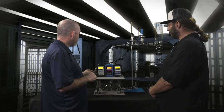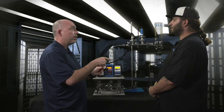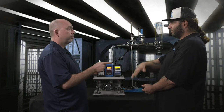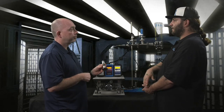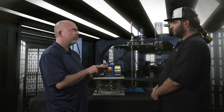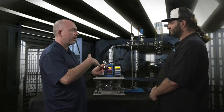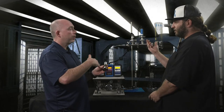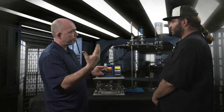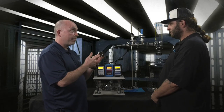There's another sensor — a compound sensor — that we actually used on an extraction system for closed loops. You can pump the system down and watch it go all the way down to the lower micron range, and while it's operating it will tell you digitally what the pressure is. This compound sensor goes down to about 30 torr in vacuum, which is effectively 29 inches of mercury, and up to 100 psi. It also has an isolated diaphragm so other chemicals won't affect it.